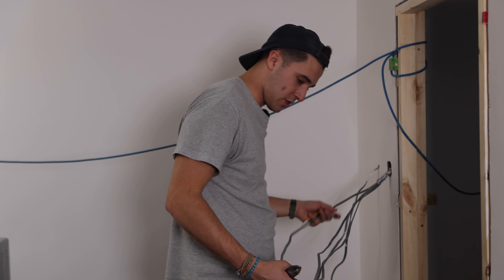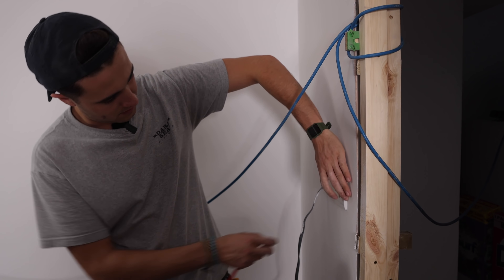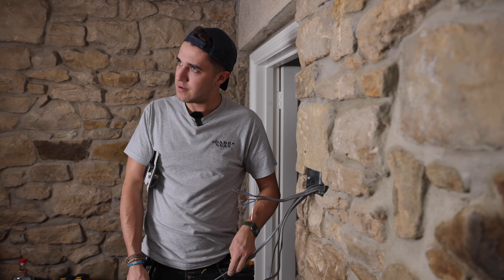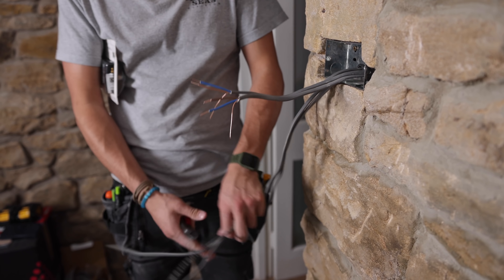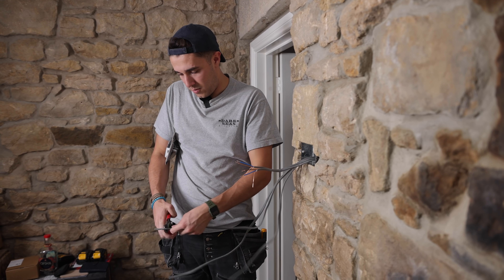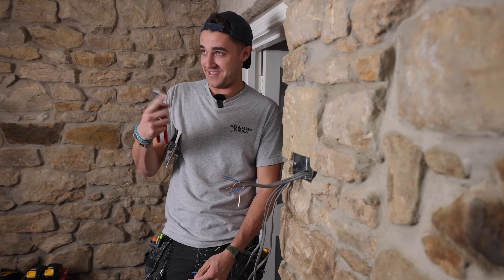So this is just a single switch going here. It might trip your RCD — I'm shorting out the neutral in earth. I won't turn that on just yet because that's going to make it live out of here. Annoyingly, I think I might not have labeled this, or maybe I labeled it and someone rubbed it off. That one's LED tape, that one's feed in, feed out, and then all your loads through that one — I'm pretty sure that was how I did it. Only one way to find out: we'll test it. Come back soon when we've tested it.